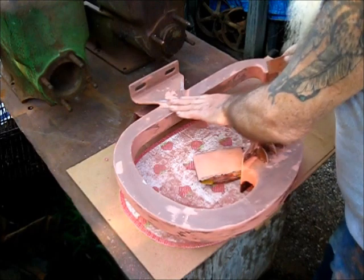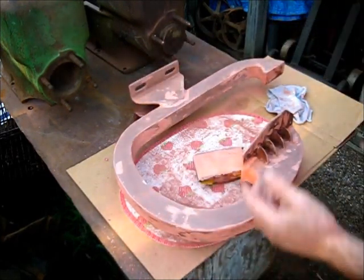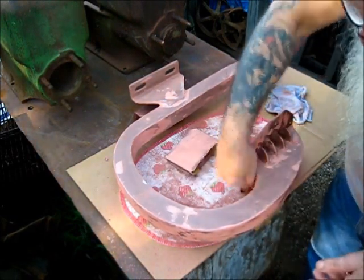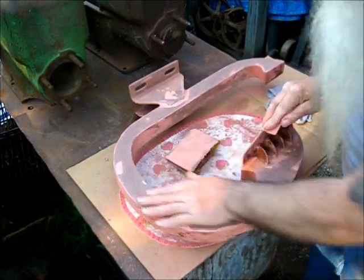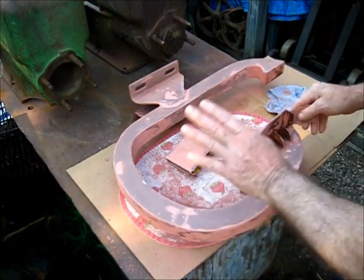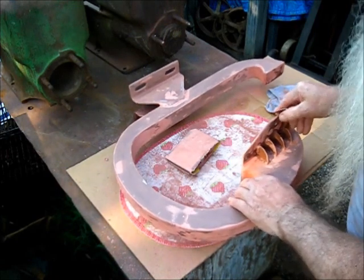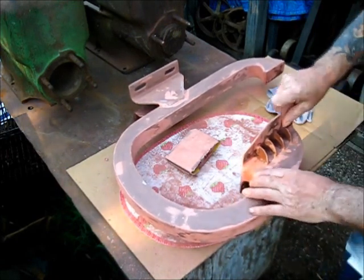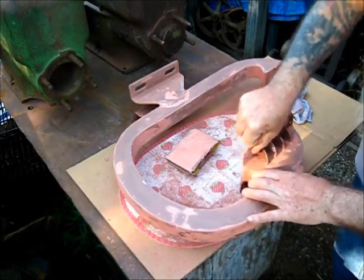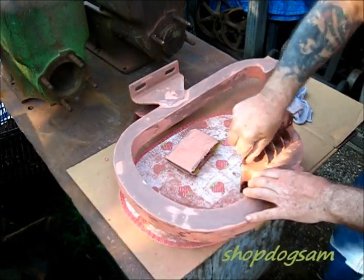Okay, see, and using the light, if you're doing this right here, you know what I'm talking about. Using the light as a guide. See, when I look across through yonder, I can see different colors. Most of the time, where it's not been sanded is a glossier color, a slick color. And where it's been sanded, it'll be a whole different color and texture also. So you keep your eye out for such areas.